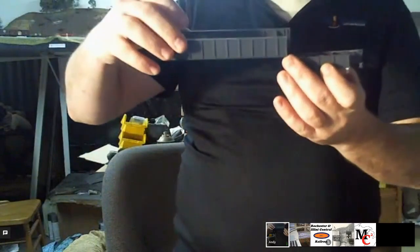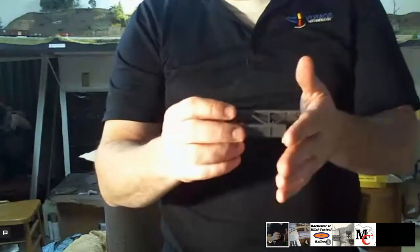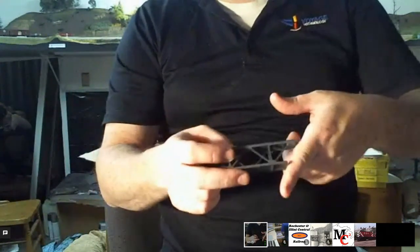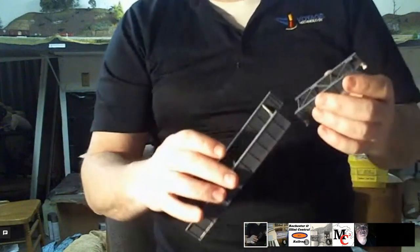So I've got to build the piers with the offset. It's askew on both sides. It hits the bridge abutments on each side with an askewed position. It's on a curve, and it's in the easement. So the curve radius starts at like 72 and goes to 60. So it's not even a fixed curve radius, and it's the first bridge I've built in 2 decades.